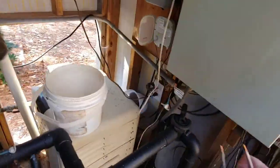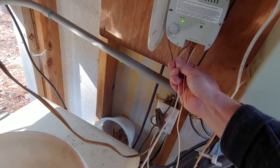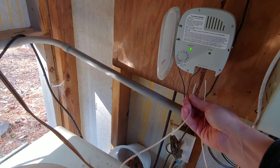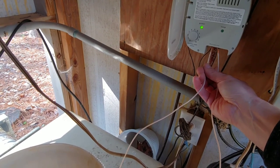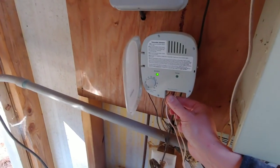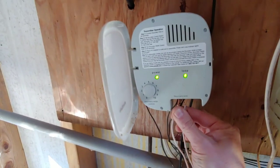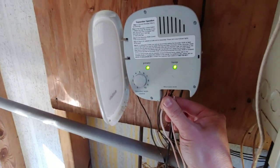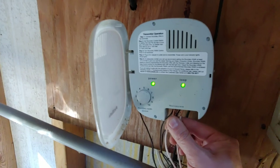Let's go back over to the system we have. You've got a boundary wire here and a power wire coming in here that just powers the system. It's also good to have a transformer to protect your system. Now I'm doing my loop test — I've got the wire on both terminals, creating a loop. What this is telling me is that my system is likely good, but I've got a break somewhere out in my yard that I need to find.